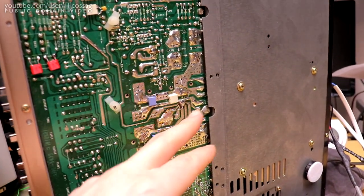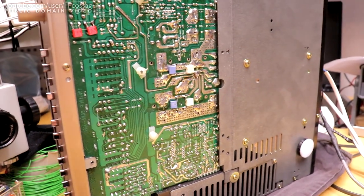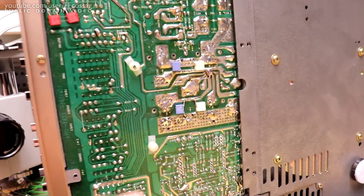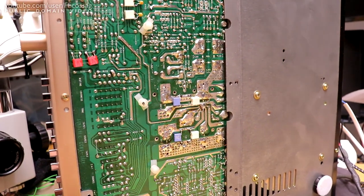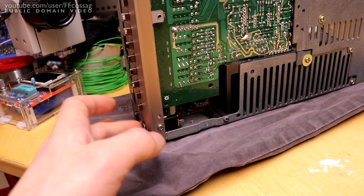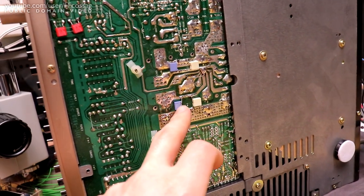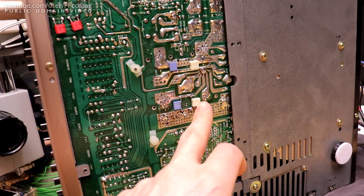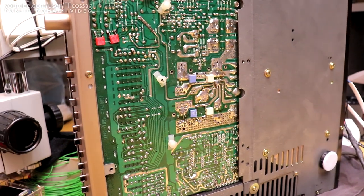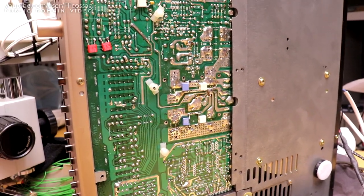The original design doesn't have any small filter caps across the main caps, and the entire thing seems very susceptible to mains hum — some noise from a transistor working with the ripple as well. The headphone output in particular is very sensitive to noise, and I haven't figured that out; it sounds bad and I don't know why. I have added a 15nF and a 47nF cap just to get rid of any potential high frequency noise. I didn't measure any difference from those, just put them in to see — and they're going to stay there.